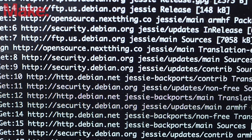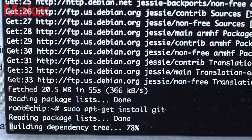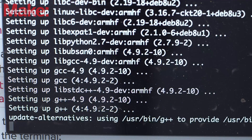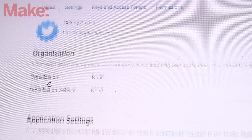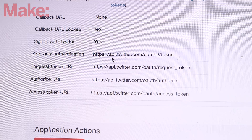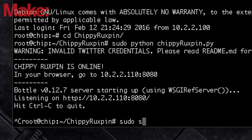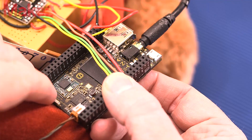Update Chip using apt-get, and then install git and clone the Chippy Ruxpin repo. You'll need to install a few more packages before we finish up — these are all the various systems that the script calls on to make Chippy Ruxpin speak. If you want Chippy Ruxpin to be able to connect to Twitter, you'll need to create a Twitter app through their developer site and add your authorization keys to the script. Once you have everything in place, shut Chip down. Connect a single-cell LiPo battery to the connector on the board and press the power button for a full second to power Chip up again.